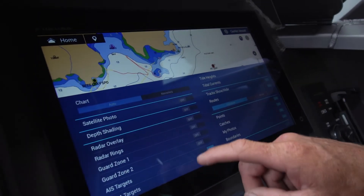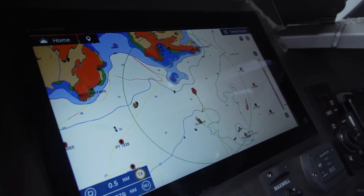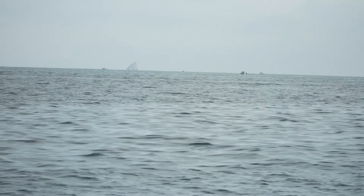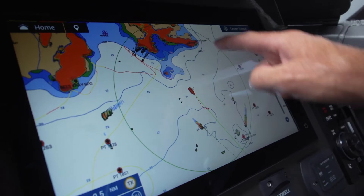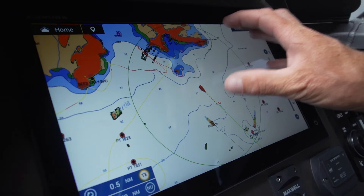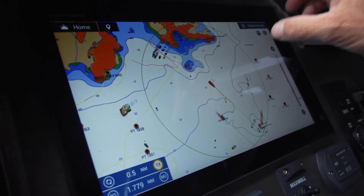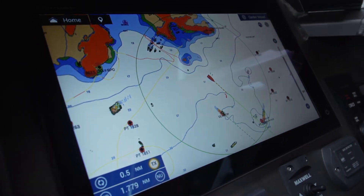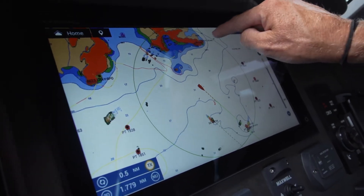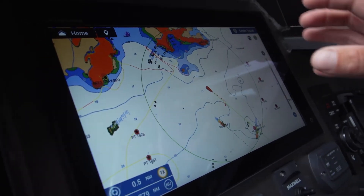We can go a step further and overlay radar. The radar is clearly picking up the Silver Tip, but it's also picking up a bunch of fishing boats around Onslow Rock and the mainland. The radar overlay is really useful because it shows you exactly what's there right now. GPS isn't always accurate since satellites can fall out of range, but if the radar overlay is following the contours of the land, you know your GPS is accurate at that point in time.